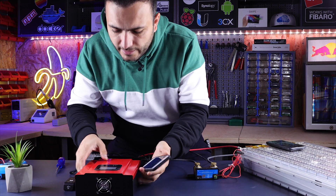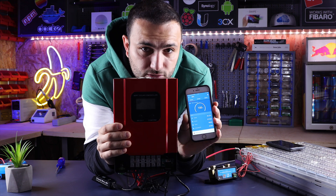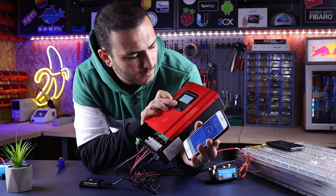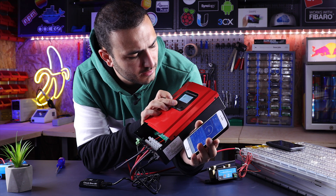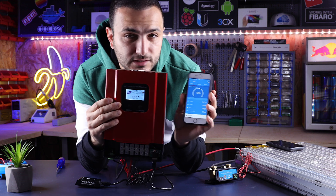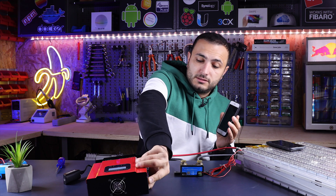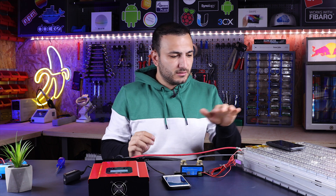In this moment I have on the device 800 watts, and also on Victron — let me turn on the display. There are many functions on the display so you must be careful when you press, because you can't go back easily. Reading: 1068 watts. On the Victron you can see it's the same — I have 1061, 1065, 1064. This test is to see if the information shown on the LCD display is the same as what is going to the battery.